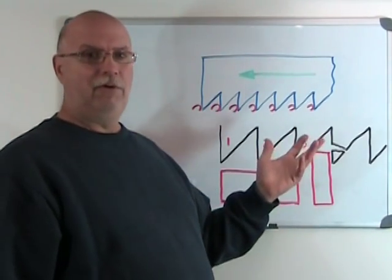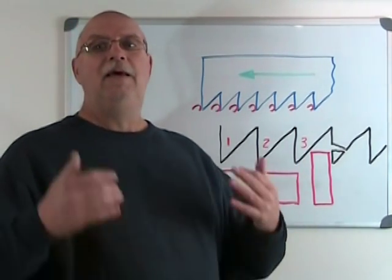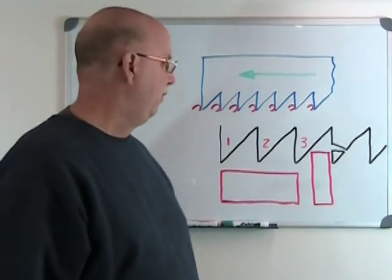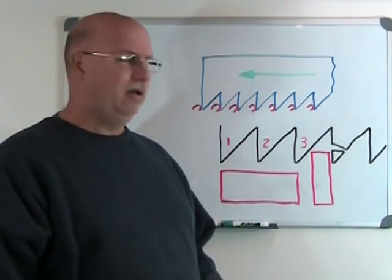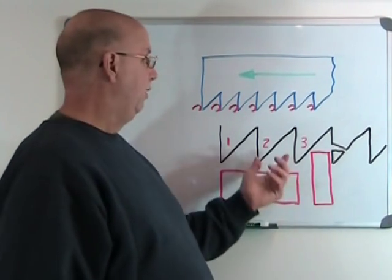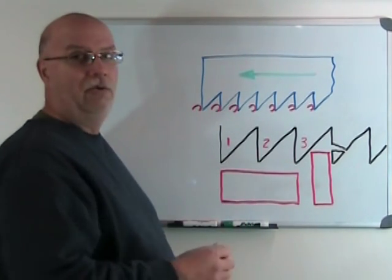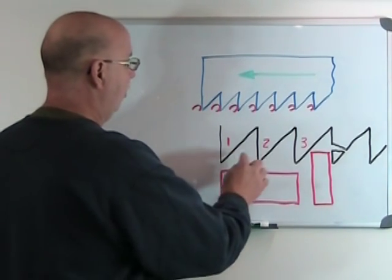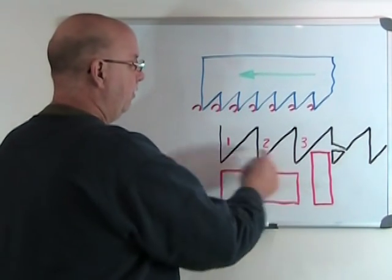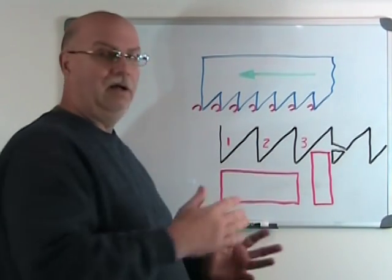Really, the only main difference between the cutting action of saw blades and files is the minimum contact rule. Files don't have that rule, but saw blades do. When we're sawing a part, there have to always be two teeth in contact between the saw blade and the part. In this sketch, this rectangle represents my part. I have one, two, and three teeth — about the same length. As the first tooth exits, the third tooth kicks in, ensuring a minimum of two teeth in contact at all times.